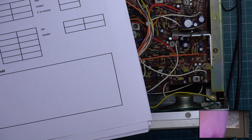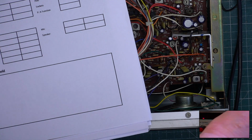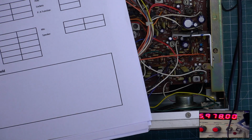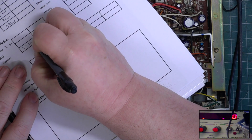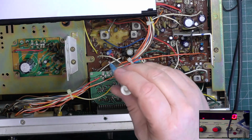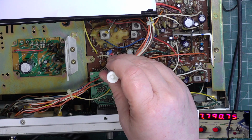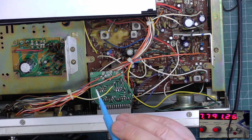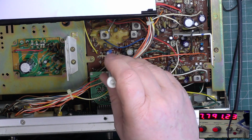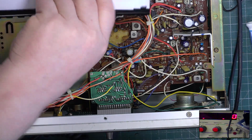So gear's been on a sufficient length of time, so we'll go over to the frequency counter. We'll see what it's doing frequency wise. I've got some blockage in front of the... Is that better? A bit. 2779074. I'll do that right away, then it saves having to set the signal generator off frequency, doesn't it? So that wasn't illegally off frequency, but it was probably sufficient to be noticeable.